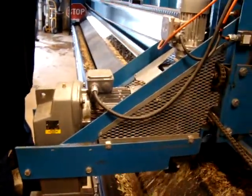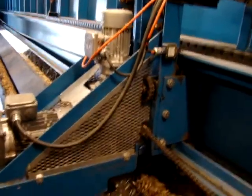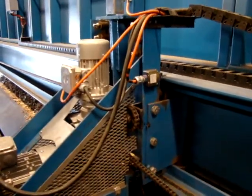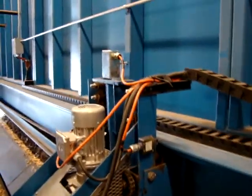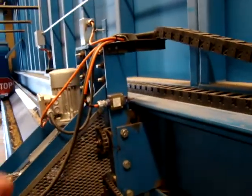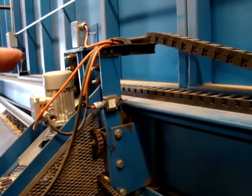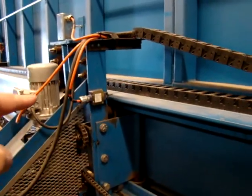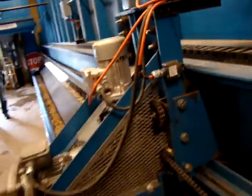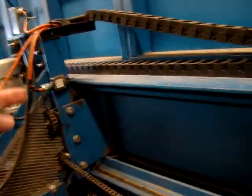Here's the gear motor that drives the auger. This is the feed motor — the feed drive to move the chain. And you've got these little limit switches up here. This tells the tilt of it. This one must be when you get to the end of the travel — see that one right here. So if I touch that thing it would stop and think it would go the wrong way.